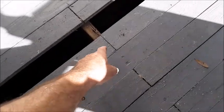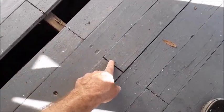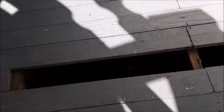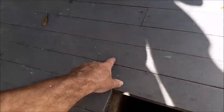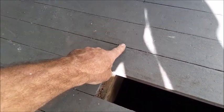As you can see, we've actually replaced several of these over the years. We skip every other one where we splice on top of the underlying beam. On the next row, we come back to the next beam and splice every other one on that beam. So this being one of the original ones, it goes up and we've already spliced the ones on either side of it. We'll take it up to the next beam at about four feet and cut it right through here.